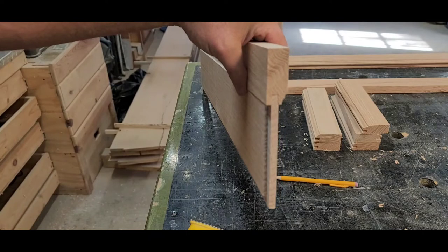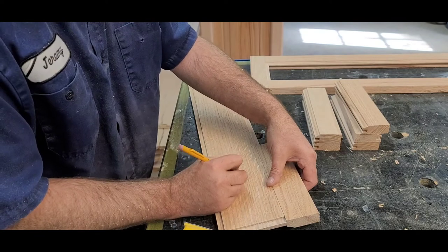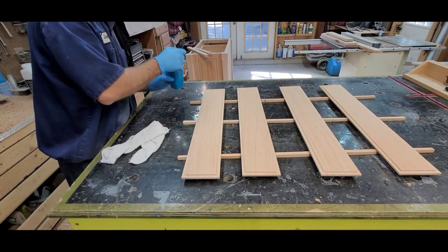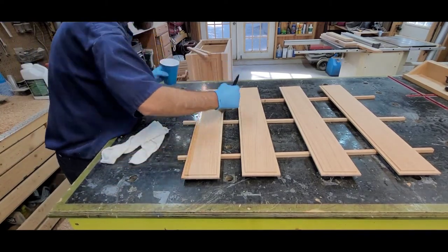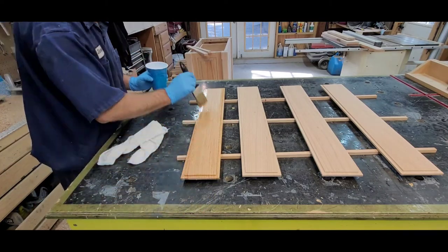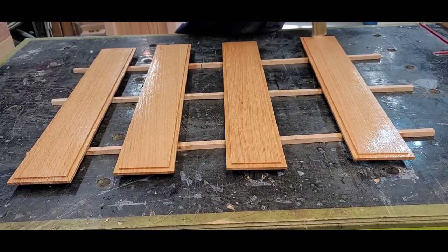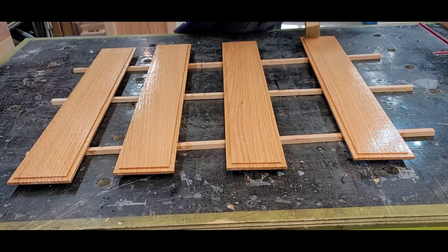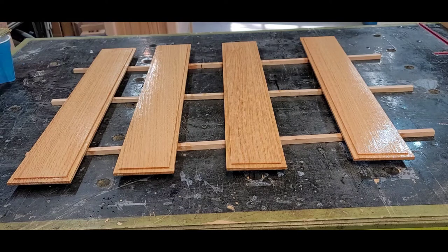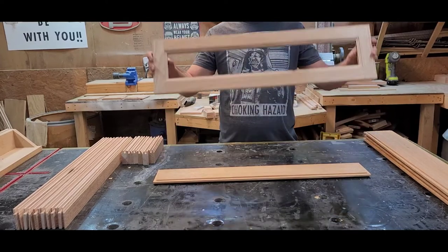Because I can't remember anything, I write 'back' on the backside of all four of them. Then because these are solid wood panels, I go ahead and finish them before putting the drawer fronts together - that way in case they shrink it doesn't show an unfinished surface. Look at that, those things are beautiful. I love this Armor Seal on this white oak, it's pretty. After letting that dry overnight I come back to assemble the drawer fronts.